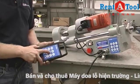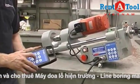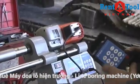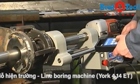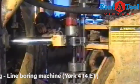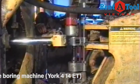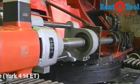The feed carriage weighs 60 pounds. The 414 ET operates on 110 volt, 60 hertz. For our international customers, it's available for 220 volt, 50 hertz operation. This unit is extremely portable. It can run on any plane from horizontal to vertical, allowing the operator to repair even those hard to get to bores.